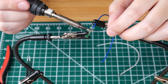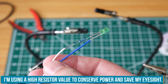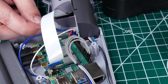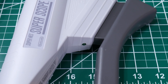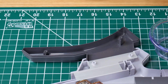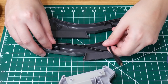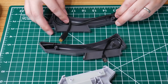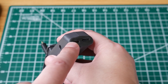One thing that bothered me about the original SuperScope is there's no power indicator. That's a problem now that we're using a Raspberry Pi, because we can't just cut the power without risking SD card corruption. There's a trick where you can wire an LED to the transmit pin and it'll show power status if you enable the serial port. Finally, let's add ports for power and an external display. It's USB-C, and you could use a battery pack as long as it outputs at least 2.5 amps. I've got short extension cables routed to the outside of the case, using moldable glue to fill in the gaps.